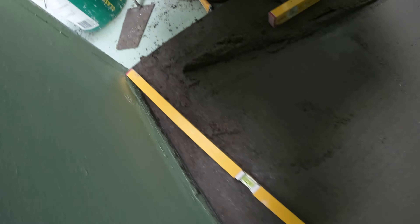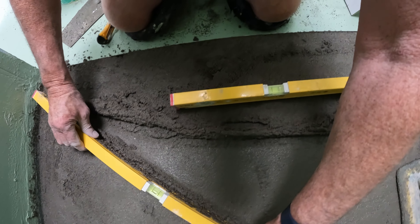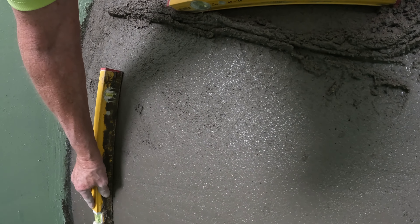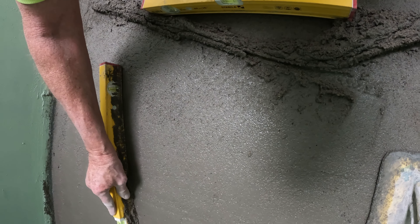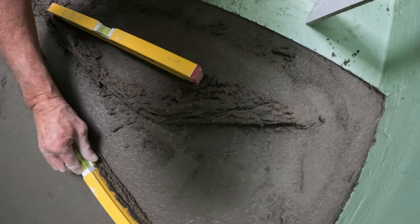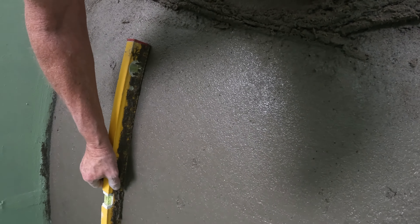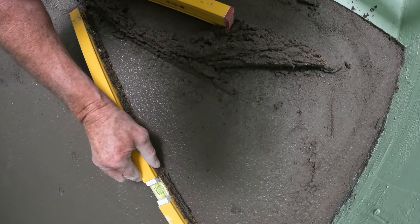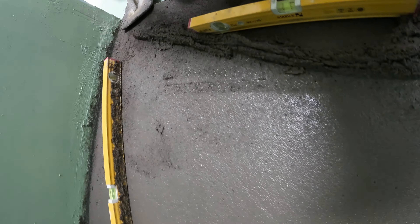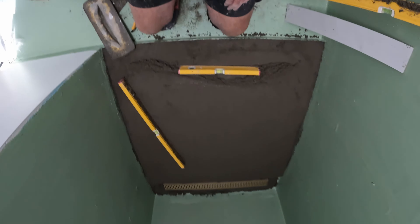See the fall there — absolute beauty. When you're screeding, just put your straight edge and run it over gently. You can always be a little bit — you know — like you're using a 12 mil notch. See that, beautiful.